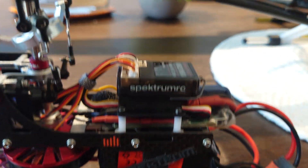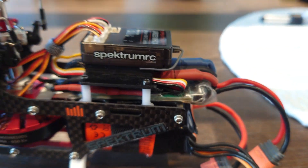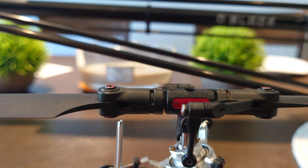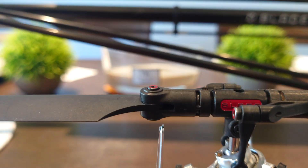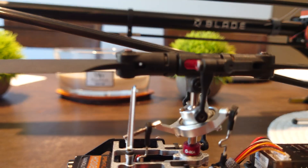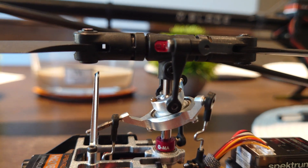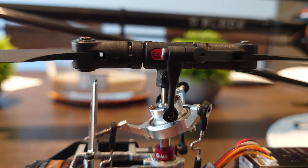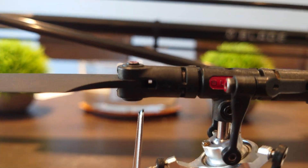I've rerouted my wires and made things a little neater. Another thing I want to point out: most of you have had the issue where the head block teeters on top of the main shaft. That's not because of the head block — it's because of the main shaft. The main shaft is not protruding deep enough into the head block; it's too short. If they had made that main shaft a little longer at the top, it would have been fine.